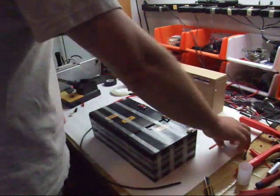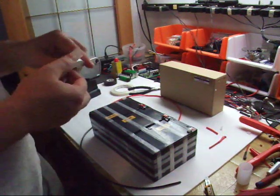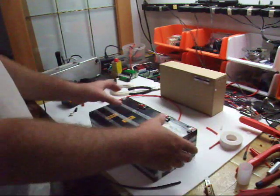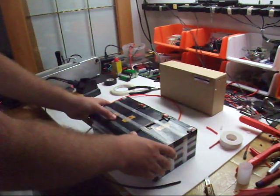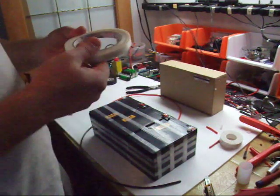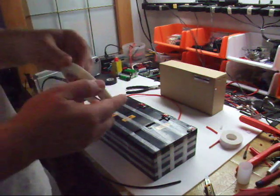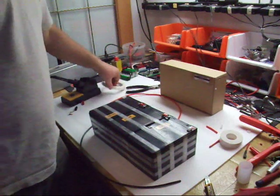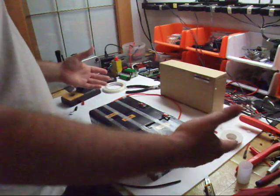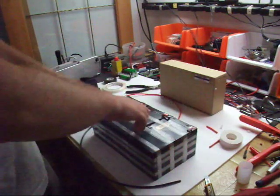To assemble the bricks, I took some double-sided foam tape — found this at the dollar store, a buck for a roll of it — put three strips between each battery and stuck them together so they don't rub against each other. Once they were all assembled into a mass, I took some filament tape, also found at dollar stores, shipping centers, Costco, Walmart. It's just shipping tape with nylon filaments in it — basically string. Once they're all stuck together, it's as good as Velcro or zip ties, or anything else that would hold the cells together so they don't move and loosen up your connections.